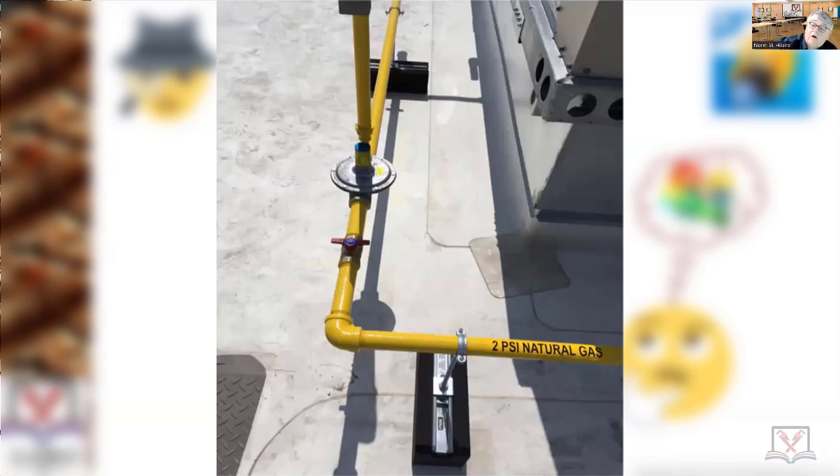What it doesn't have down there is a label at all. As a plumber or gas fitter you're supposed to know that the reason that regulator is there is because it's kicking pressure down to low pressure — less than a half PSI, less than 14 inches water column. The whole idea is that if you see something like this on an exam, or better yet on a job site, you can tell the direction of flow without any arrows just by looking at how things are set up. It takes a little time to develop that situational awareness, but you can do it — you have to want to do it. The key components here — the labeling, that shutoff valve, that regulator, that vent — those are the key points. That was a pass.